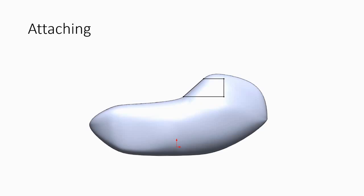For attaching the windshield, again, there were 2 methods the team considered. Notably, the windshield may be riveted in place regardless of how it was created. Since the windshield would already be formed, this method would no longer be greatly stressing the acrylic. However, the team noted that when we were drilling holes in the fairing and windshield, if any mistakes were made, especially in the fairing, the team would be majorly set back in production.